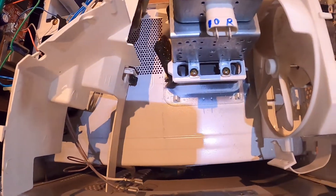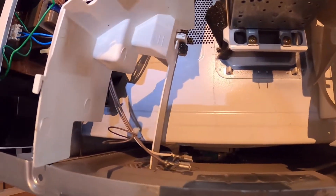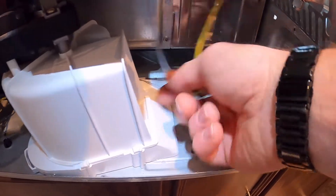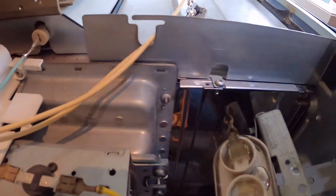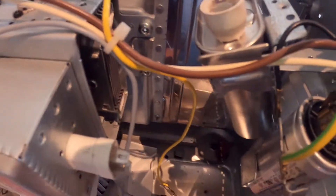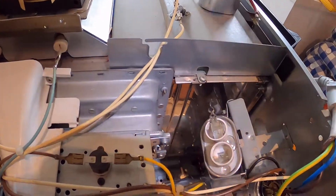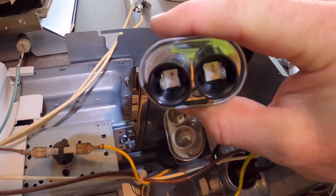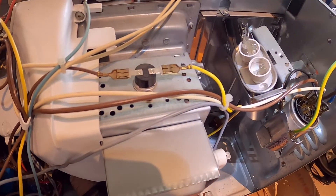We've whipped everything out of the Panasonic — the cap, the diode, and the transformer. On the Whirlpool, we've got the power leads still coming in the same with a bit of flex. I've put the Panasonic cap in because it uses smaller terminals. The Whirlpool capacitor was using larger core latch terminals, so because I'm using a mix I'm going to re-terminate some of those leads.